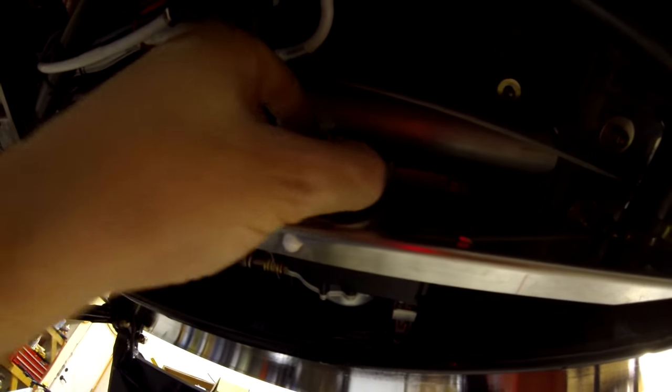Underneath the airplane is an access panel — in here is where you have all your starter relays, master relay and such. They've got a 40-amp breaker just to protect the wire that sends power to the main bus. Keeping all the wires clear of the cable run — the servo is up here and it's hard to see, but this will get drilled once I'm satisfied with the rigging of the airplane. Right now it's just clamped. Once it's drilled and the torque tube for the autopilot is in, I can rig the elevator and fasten the cable system for the elevator portion of the autopilot.